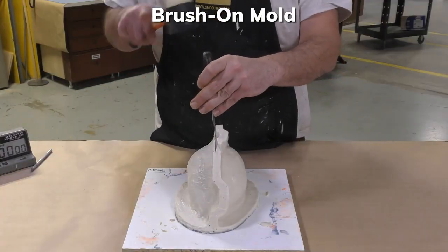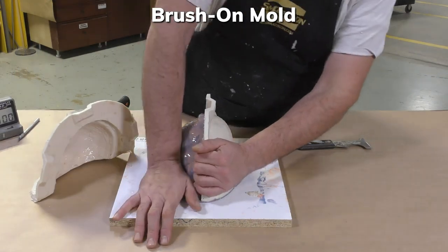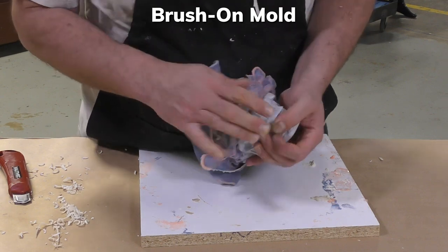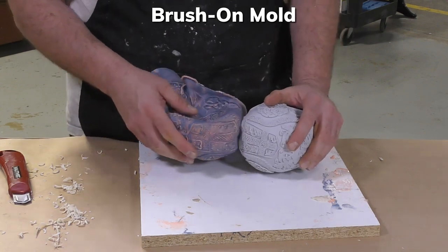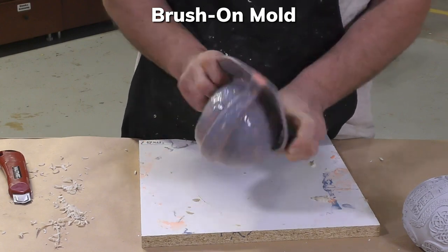After a 6-hour cure for the Rebound 25 and a 3-hour cure for the 2 sides of the Plasti Paste 2 support shell, we're finally ready to demold this project. And as you can tell, just the curing of these materials took way longer than the entire setup and making of the box mold that we created earlier.